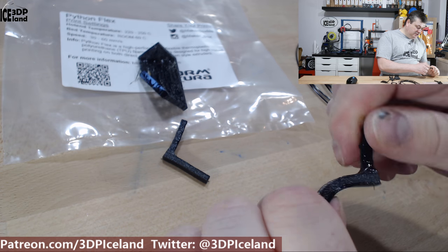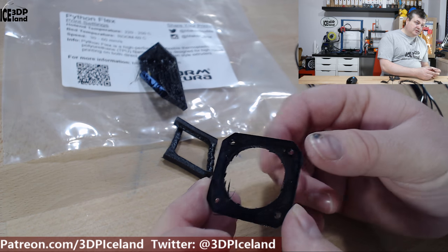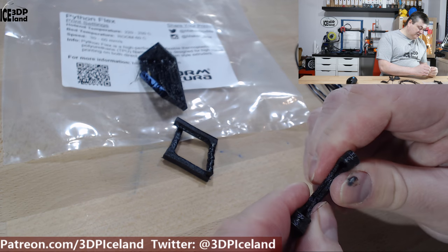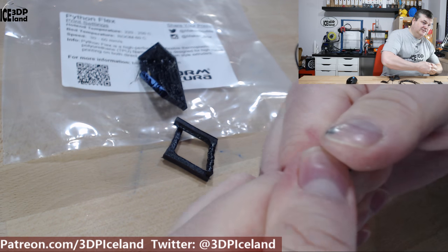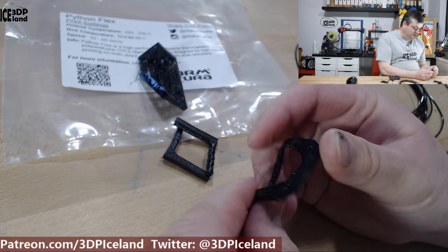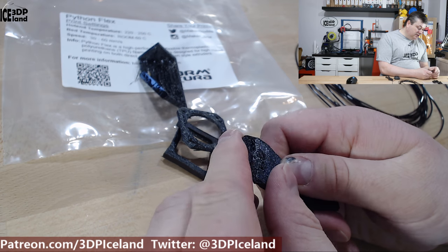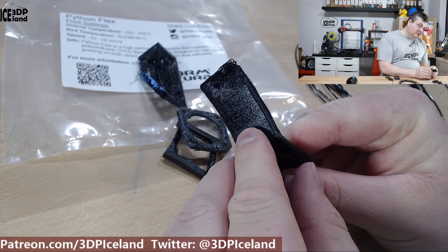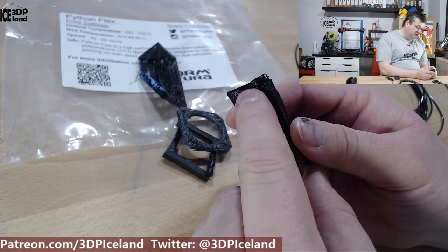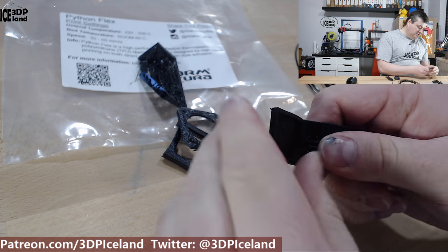It's very difficult to destroy — I'd say it's medium flexible, quite difficult to bend but it does bend. I printed out this gasket to create a mechanical part and it came out pretty decent. The top layer wasn't very pretty but it was flexible and very strong — there's no way I can break this gasket by pulling on it. Then I printed out this overhang test. At 60 degrees it was starting to fail so I cancelled the print, but at 45 degrees it came out pretty good with no issues. So 45-degree overhangs are achievable with this material, which is quite good for a flexible filament.